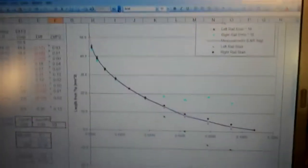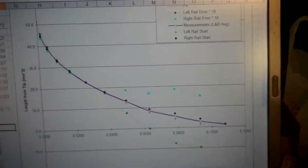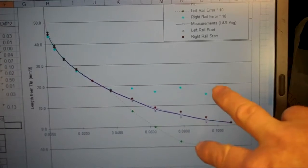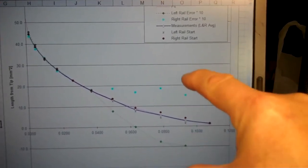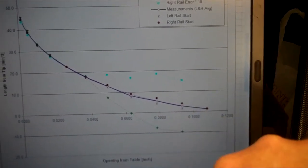I've taken facing measurements across here and plotted them on my PC. What you see is from about here on out — by my system I exaggerate the left and right rail readings so that I can see how twisted it is. This helps me when I'm dialing in the facing work, but this is so bent this is huge. Usually this is much less than that and I'm just fine-tuning. The rest of the facing curve is fairly smooth, some minor bumps, but the tip is horrendously crooked.